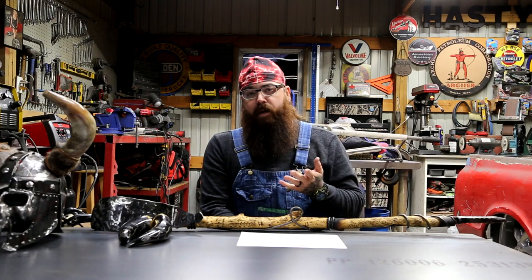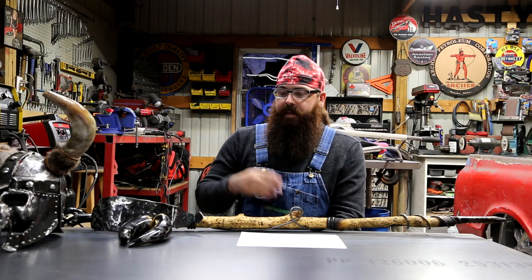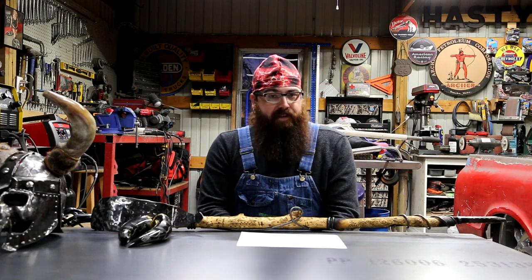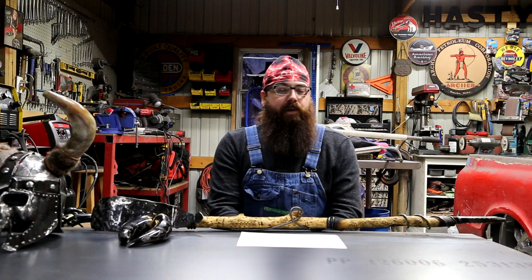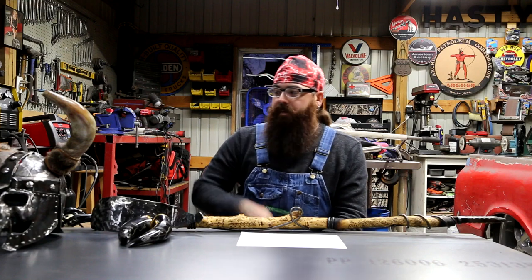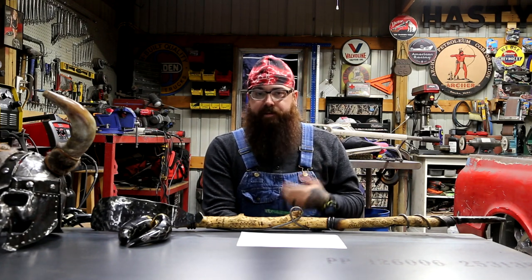So, to try to save weight, because it is wearable, I bought a sheet of 16 gauge. 16 gauge should be in the realm of what I like to do as far as shaping. Obviously, it's not that much different than 14 gauge, but it should weigh quite a bit less overall. And I also am going to replace the 1.5 inch strap with some 1 inch strap, 1/8 inch.